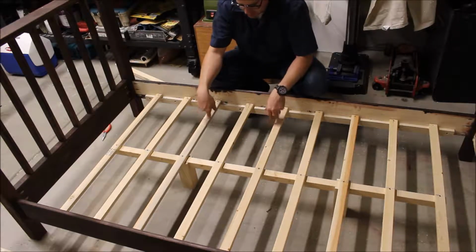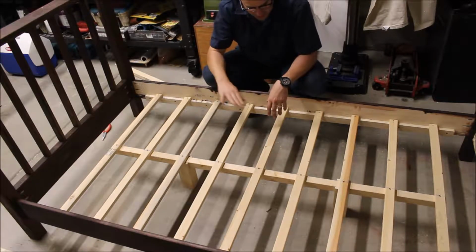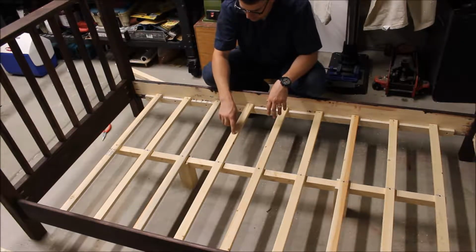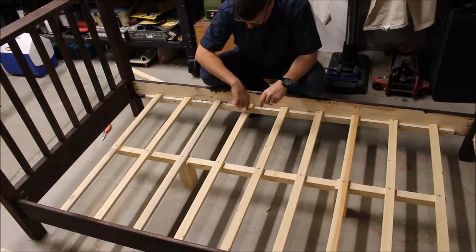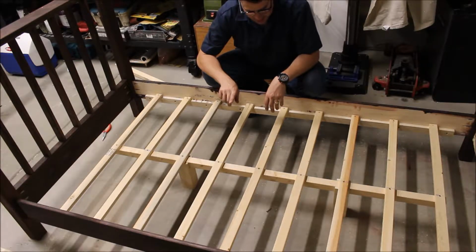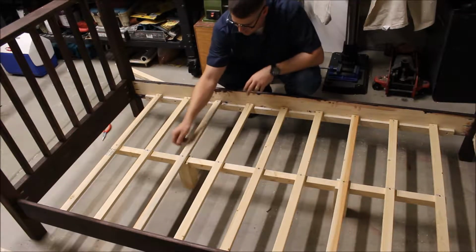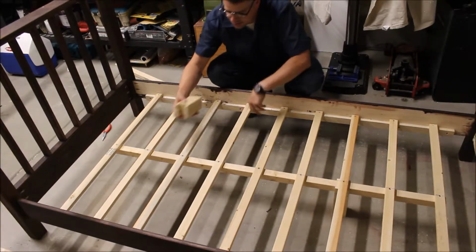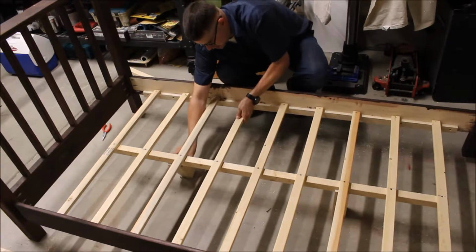Cut all the slats here. And the other bed, it kind of droops down. This cheap pine doesn't work very well for holding the bed up, especially with no box spring. It splits real good because of the screws in the edge here. So I was a little more careful on the other side, didn't split as many. I put this little piece of 2x2 in here. And then you missed me cutting these out too on the table saw, just to add that support in the middle.